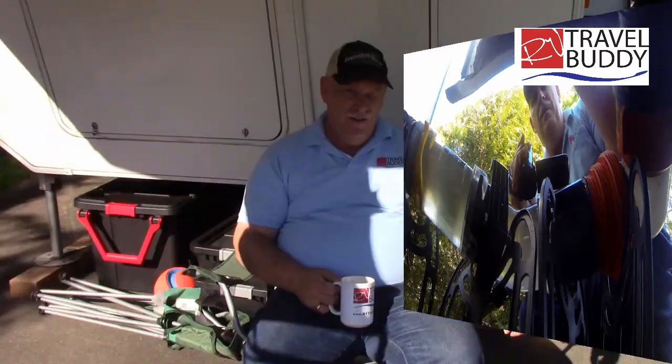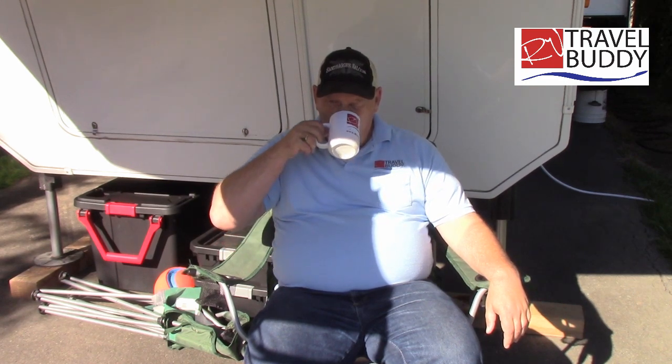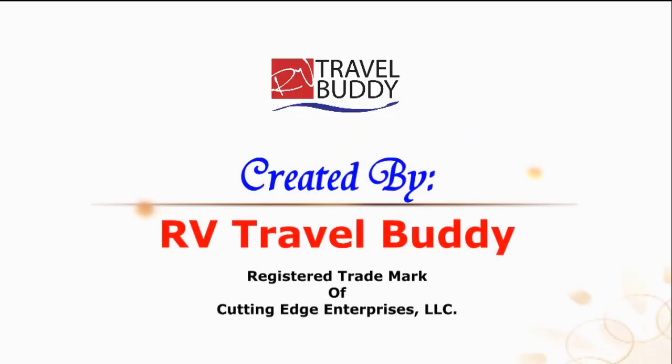So that was the end of our test. I just wanted to show you how well the back flow system works. It's a great way to flush out your tanks. Lesson learned here — make sure you use good toilet paper that breaks down in the tank. We're suffering from the fact that we did not use the right kind of paper, and I'm going to be doing this process quite a few times until I get all that paper out. Lessons learned, learned a new tool, grateful for it. I'm Rob Scribner from RV Travel Buddy. Have a great day. Bye now.